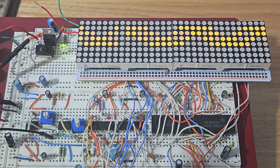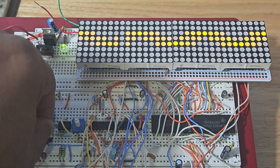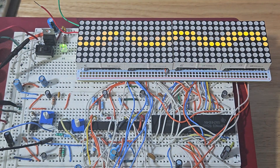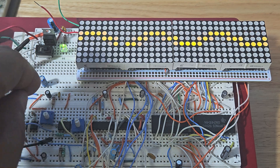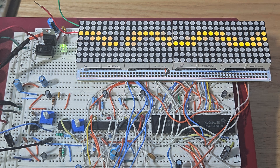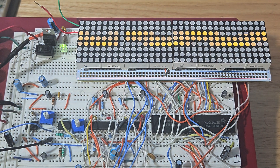The other output — I only have two outputs broken out. It gives three: square, triangle, and sine. So I'm just going to take my other lead, unplug it and plug it into this. Here's a sine wave, so I should be getting a nice sine wave on my oscilloscope. There it is — let me try to get it better. I may have to get a different type of potentiometer. These little blue ones are really hard to adjust for this type of circuit. You got to get the timing down. I'm going to try to adjust it on the function generator. There we go — you guys see that? Slick.